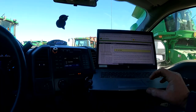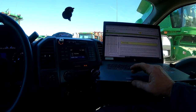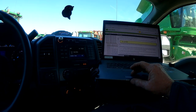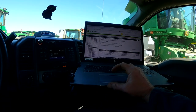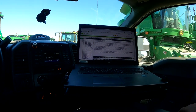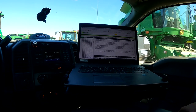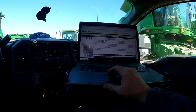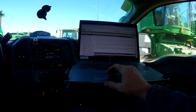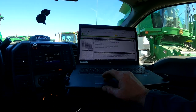We're going to look up this code in Service Advisor and chase down the problem. We're in Service Advisor now, looking down to find that SR1 controller, looking for SR1 168.04. I like to look at the theory of operation — it's pretty helpful to read through that and see what drives through that circuitry. Glancing through it, we can see there's an F302 fuse that provides protection for the circuit, and a 10-amp SRC fuse F102.